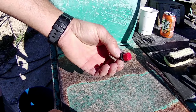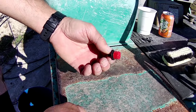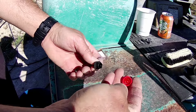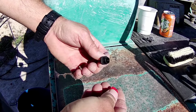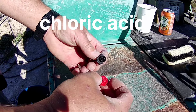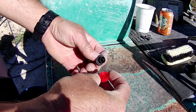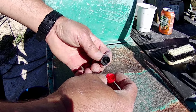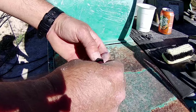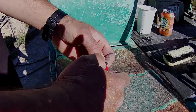These ones, about once or twice a year, you have to give them a really good clean. Because we've got the pipes up, I've taken these ones off completely. I've taken them home and soaked some in acid to clear all the scale, because the water's very hard here and all these little holes get clogged up with scale. I gave them a good clean out with the air gun, and now I've brought them back to fit them back onto the pipe. So I'll stop recording now and I'll bring you back in as I start to roll out the pipe.